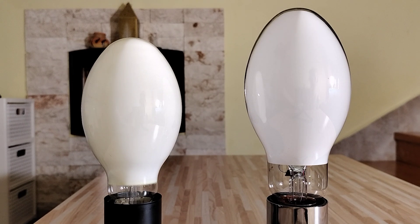This white coating means that we will have very nice diffused light with these lamps. The white thing is the phosphor, and this white phosphor powder converts invisible UV radiation into visible light with some specific color temperature and color rendering.